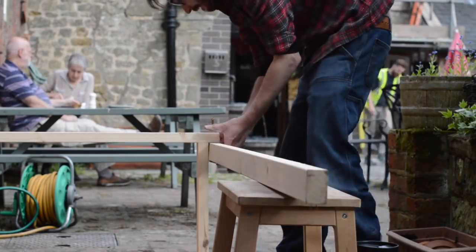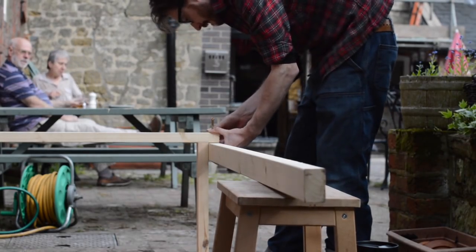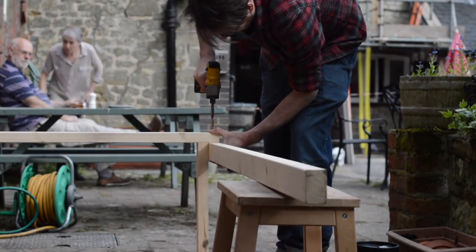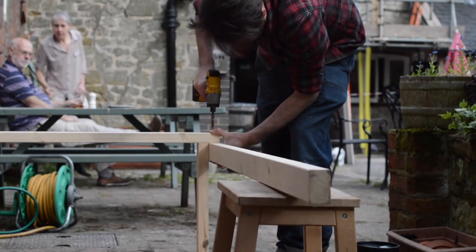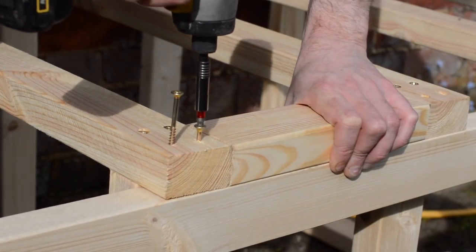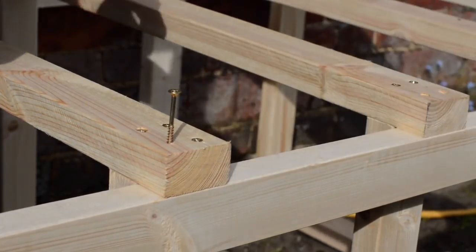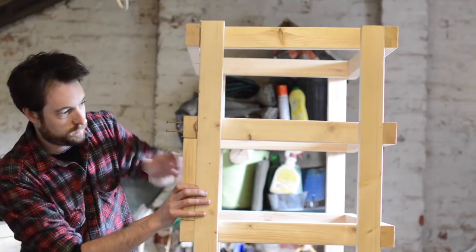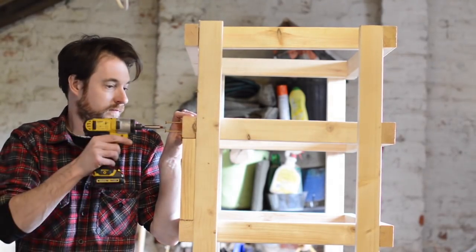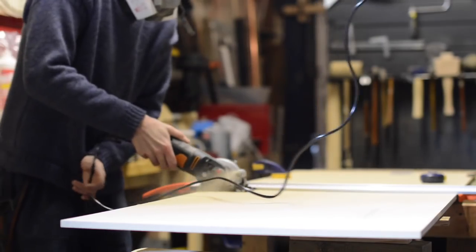As I have so much mess I didn't actually have enough room to work, so I came outside on a nice sunny day to actually put the thing together. I screwed the first shelf on. I used a scrap of 2x3 at the bottom as a spacer to leave a gap. I cut another 2x3 to space out each shelf — this made putting it all together a lot quicker. When I had all the shelves screwed onto the two back uprights I could then stand it upright and bring it inside. Then I did the same again screwing on the two front uprights.